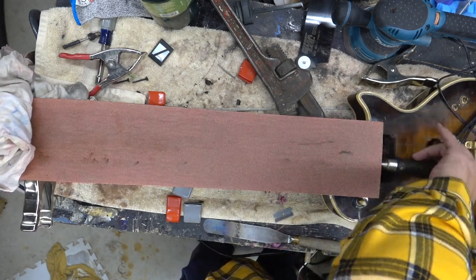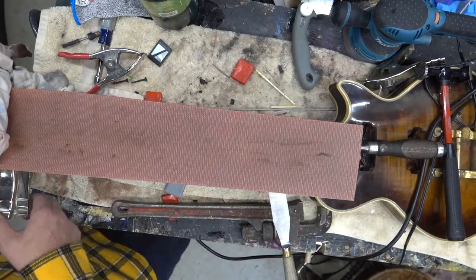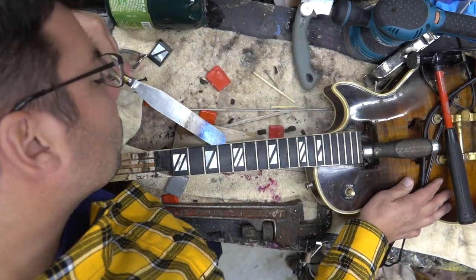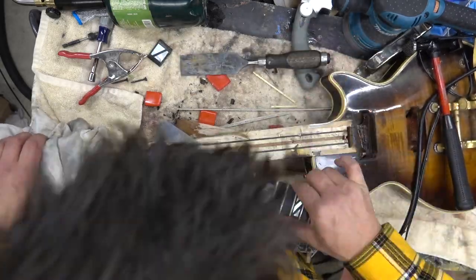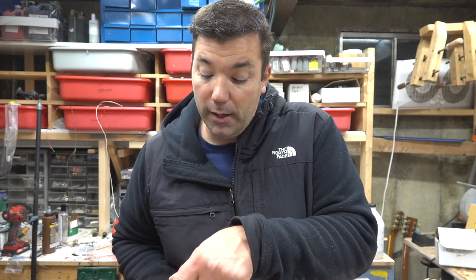Tapping the chisel and everything's starting to come up. That pipe wrench is acting as weight to hold it down. I heat the spatula up a little more — you can see I'm just breaking the seam — and here we go, the whole way through. What a mess. Next step is to pick out the truss rod using my hot knife, pull that strip of mahogany out, and then I'm not sure what truss rod I'll put back in — I might use one of the StewMac dual-action truss rods. I'll talk to the owner. If you like guitar-related content, please comment, like, subscribe, and click the bell — we'll see you in the next video.